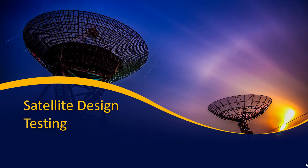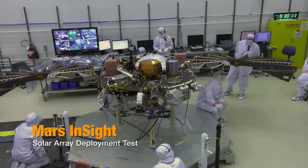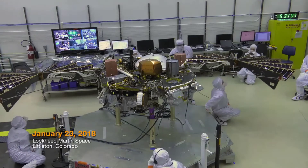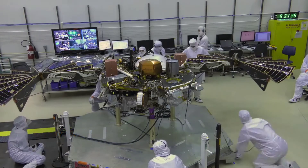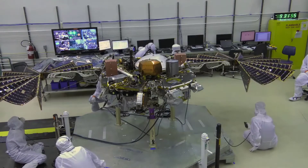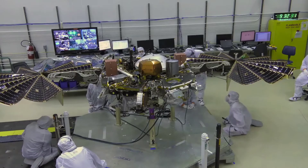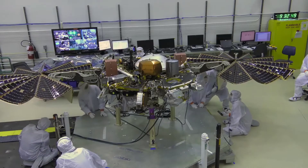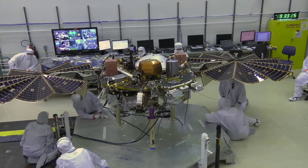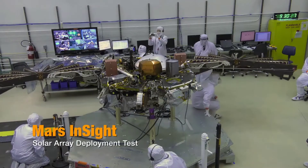First of all, you want to make sure that everything works on the ground. This is an example of the solar arrays being deployed for the InSight mission. For any kind of mission, you will want to do some kind of test of all of the major mechanical systems. You want to make sure the antennas can deploy, the solar panels can deploy, and any instruments that are deployed — well, you want to make sure they work. You want to make sure that the fault conditions will all come to fruition, that if the satellite waits long enough it'll go into the proper reset modes. You want to make sure it's working absolutely solidly before you go ahead and launch your spacecraft into space.